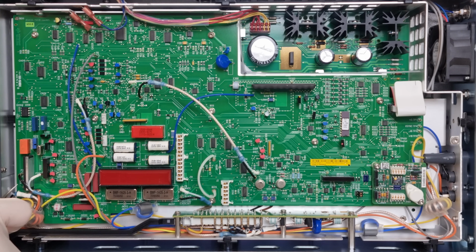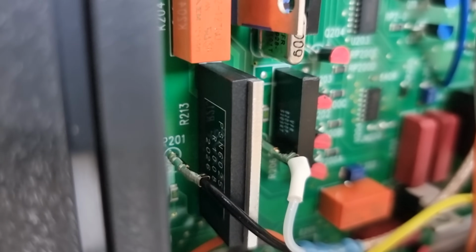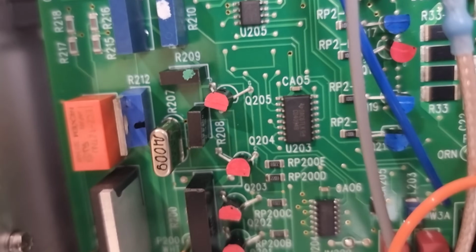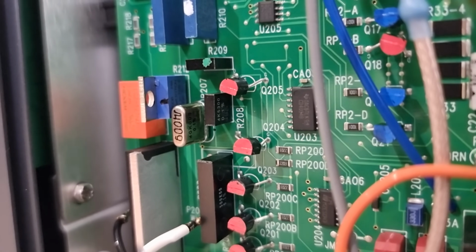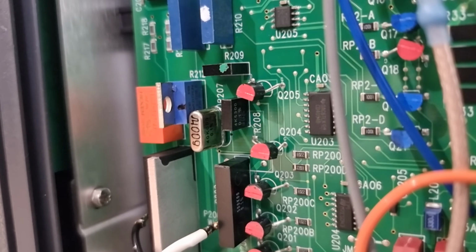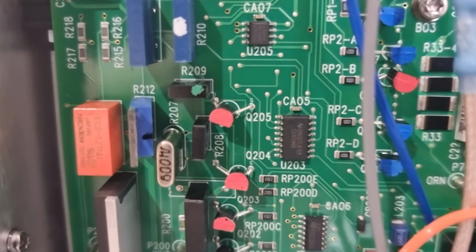The shunt resistors for the current ranges, which I may have called not too impressive looking previously, are now positively awe-inspiring. They used to be small axial metal filmers or wire wounds. Now we've got some proper plastic molded Powertron foil, and you may have guessed it, that company belongs to Vishay Precision Group nowadays. The only hermetically sealed resistor is a 40K VHP 101. It's hanging out with the foil family over here, but it's got a more important job than the other current shunts. Its fantastically low tempco makes it a great resistance standard for all the transfer functions involved in the self-calibration of the resistance and the current ranges.